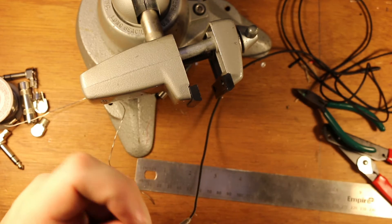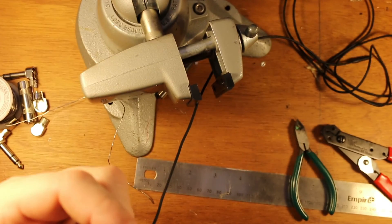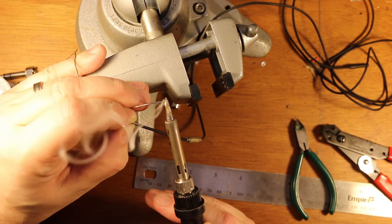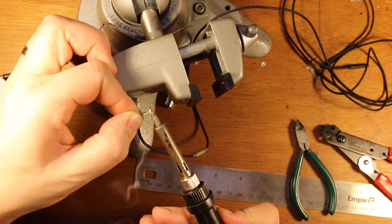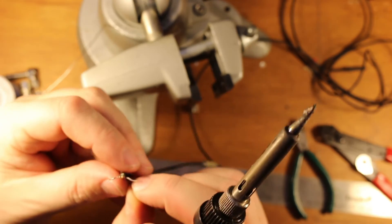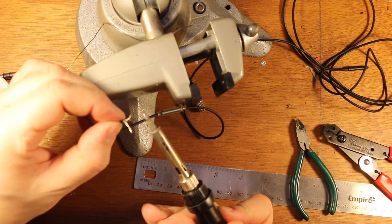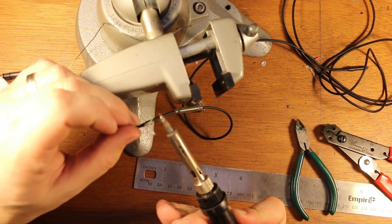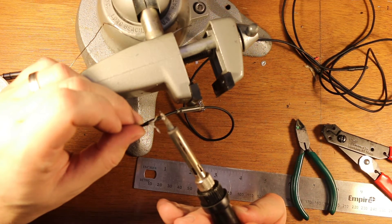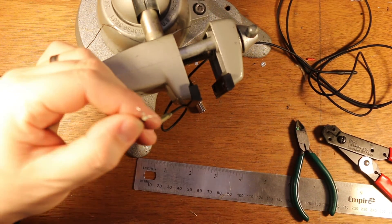I tinned my black and my white, and by the time I got done tinning the black, the white wire had pretty much just fallen off. I remember hearing some guy say that he literally doesn't even try to strip them — he just melts solder against it and it just melts away what he needs and tins it all in one go. So let's see if that works here. Just holding it on the white... oh my God, I think I figured it out! What I did was hold the iron into a big blob of solder on the tip and just melt away the plastic and insulation, which leaves them pretty well tinned. I'm going to go with that.